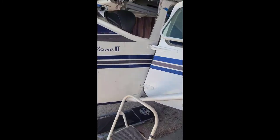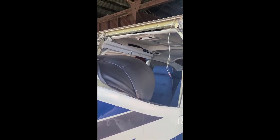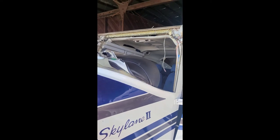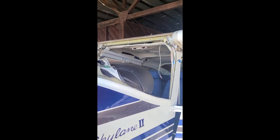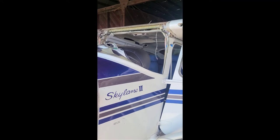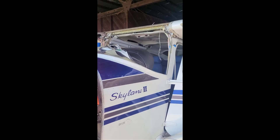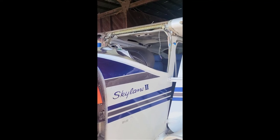The plan is to set it in the lower tray and into the sides. Quoting as closely as I can from the Cessna 182 book: using a piece of metal the width of the cabin, shoehorn the window back in. I tried it with 032 — it's not going to work, 032 is just not thick enough. If I were going to do it again I'd get some 040. I did read somewhere on the internet that somebody was using drywall putty knives, and they do come in 14 inches in spring steel, so I'm going to get a couple of those and give it a shot. I will not be videoing while I do that — I'm going to have my hands full.